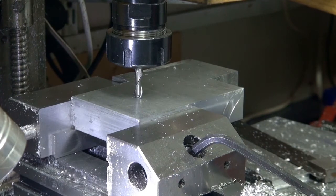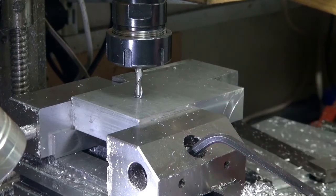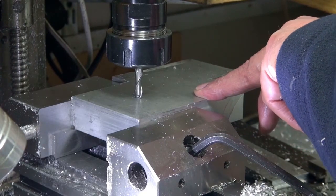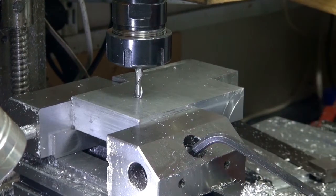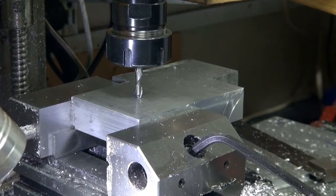Just regenerating the toolpath. As you saw in Fusion 360, it's quite a big toolpath because it's got 25mm to cut through and it's going down half a millimetre at a time. If it runs at that, I might have to alter the G-code and get it running at two-tenths depth at a time.